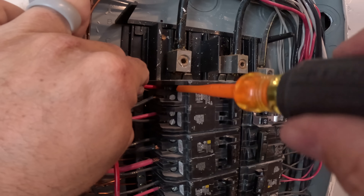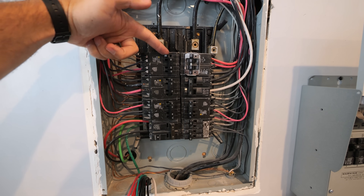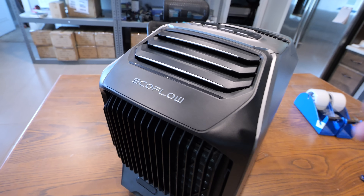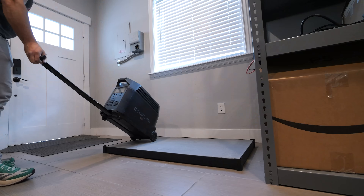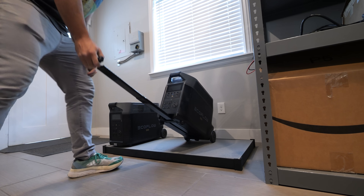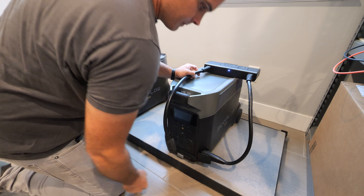A lot of the breakers left in my panel are for huge appliances like the oven, which runs at 50 amps. The washer and dryer each have a 30 amp breaker. I could have connected them since the system caps at 30 amps, but nobody's washing their clothes in the apocalypse. My mini split air conditioner also has a 30 amp breaker, but if I really need AC I can flip on the battery-powered portable EcoFlow Wave 2, which can keep a room cool for about 8 hours. We also have an electric hot water heater running on a 60 amp breaker. I could downsize all of these things or buy an induction stove — which has a whole lot less power draw — and then be able to back up everything everywhere all at once, but those aren't really my priorities at the moment.